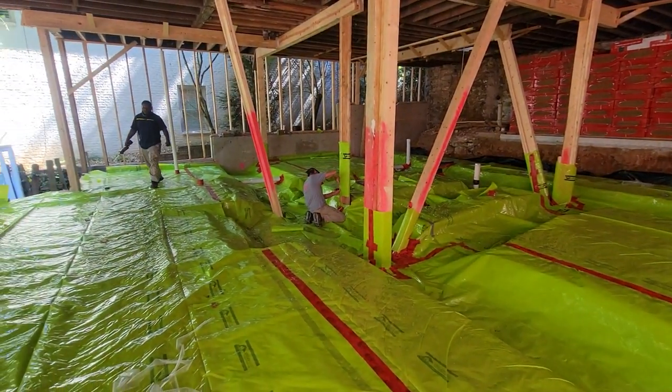What this vapor barrier is going to do is not only take care of the vapor, but also take care of the radon. With the vapor control layer and concrete on top — radon control is best with concrete on top — basically the radon is going to bounce around and not have any air leakage into the house through the slab, any moisture leakage, or any soil gases coming through, because we've got a complete seal all the way around. It's going to find its way through the gravel and the air in the gravel to the radon pipes and go through the roof. Anything collecting at the front of the house or below the slab is going to hit those control layers, go through the pipes, and go through the roof.